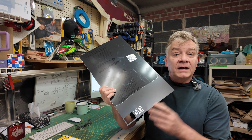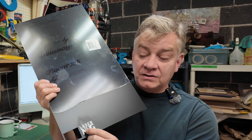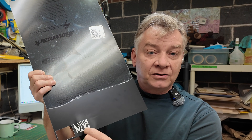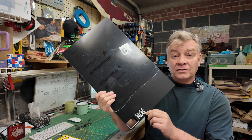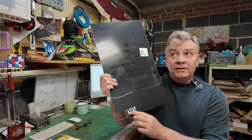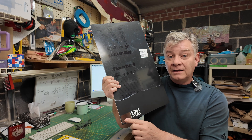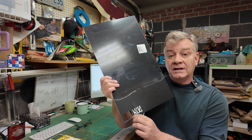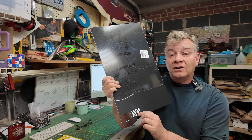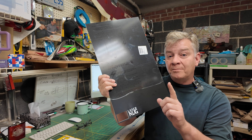With your two layer, you've got two settings to work on. One is getting a nice clean crisp engrave — the outline of your letters needs to be nice and crisp. And you've got to work on a cut layer. In determining your settings for either engrave or cut, you have to be a little gentle and test it, because if you're too aggressive, you're not going to cut the plastic — you're actually going to melt it. If your settings are not strong enough, you're going to find you can't get the whole cap layer off in one pass.